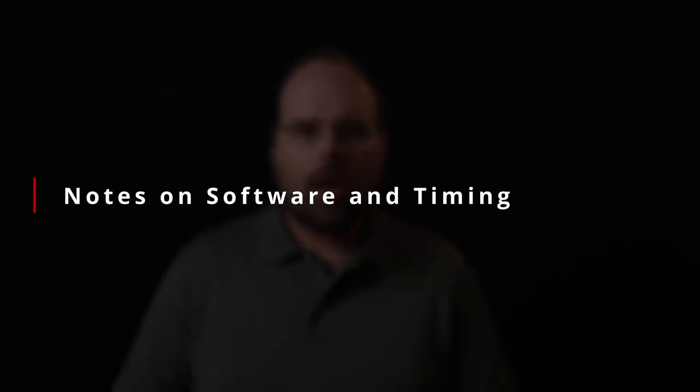So the final thing I want to talk about very briefly, I'm not going to go into how to write the software for this, but I do want to talk quickly on some software related notes, specifically timing issues and considerations. So basically, in my testing, at least with Canon gear, I have found that you can use a 100 millisecond timing or delay interval on your button presses, and the camera will read that perfectly fine and consistently and reliably as a button press or the shutter release press. So you probably can go shorter. I've never bothered trying to get it to go any shorter than that.